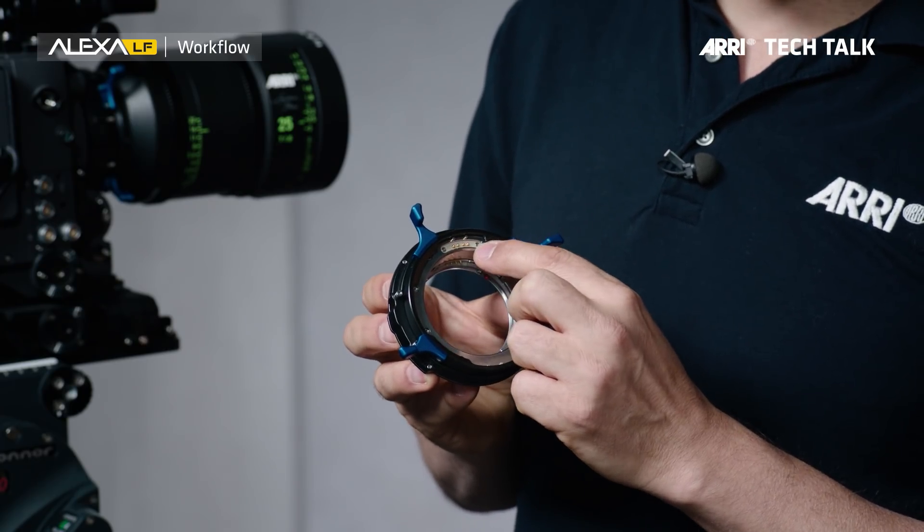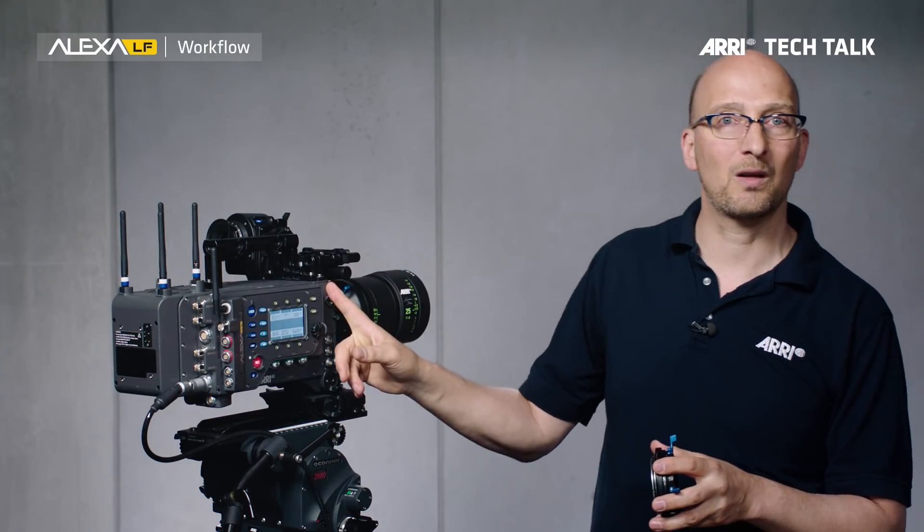With this camera, we're introducing a new lens metadata system called LDS2. You can see here on the LPL lens mount, there are four contacts for the LDS2 lens metadata. The Signature Primes can provide this information to the lens mount, which then communicates it to the camera. We're also licensing the LDS2 lens metadata to other lens and camera manufacturers. What's different about this system is that we now have absolute encoders in the lens. With the LDS1, you'd put the lens on and turn the rings for the camera to recognize the LDS. With LDS2, you put the lens on and the camera immediately knows the position of each of the three rings. We also have much higher precision and a much higher data rate, so at high frame rates we can still get very accurate lens data. The whole thing is network capable, so theoretically the lens could talk to an adapter and the adapter to the camera — that's for future products — and it is compatible with the Cooke /i metadata system.